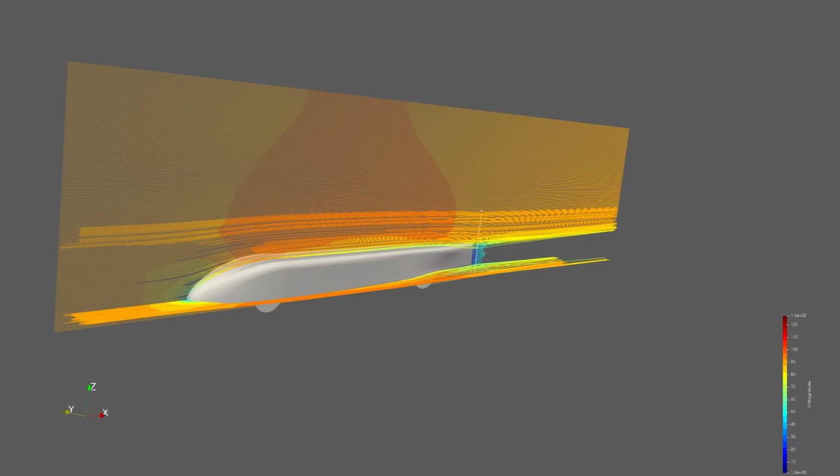slower taper towards the rear, because I'm widest up here at the front, right by the front tires. And then I'm able to narrow the entire length of the chassis all the way back to the motor in one straight line back to the tail, which allows the air just to follow along very nicely. And I'm actually really not having any side vortices anymore.